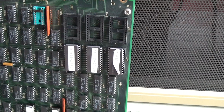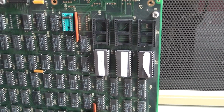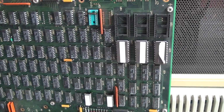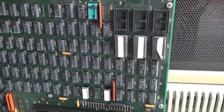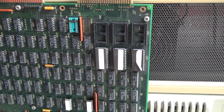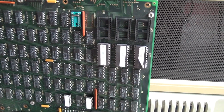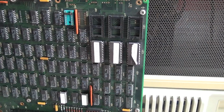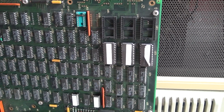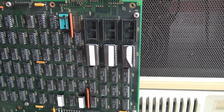Yeah, this is also one-time programmable stuff. And this machine also has the ability, if you had the right accessories, to attach a RAM. And this RAM would basically be a microcode control storage. So you could basically runtime upgrade the microcode of your CPU depending on what applications you run. You could enhance your CPU at runtime and accelerate, basically load Fortran accelerations.